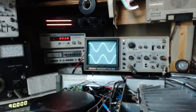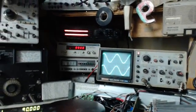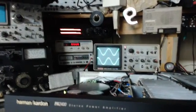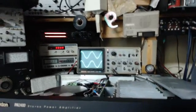And what I'm going to do so my ears don't start to bleed is I'm going to shut the speakers off. Your item is still working. It's working on what's called a dummy load now. So the item is still stressed as if it were producing sound out of a speaker, but now the audio energy is converted to heat in a dummy load. I can select 4 or 8 ohms. Right now we're using 4, which just stresses your item more. Anyways, we're going to turn this on and off a few times.